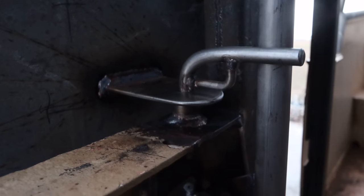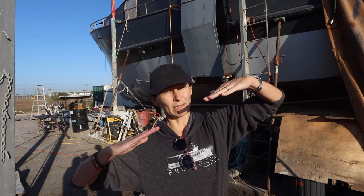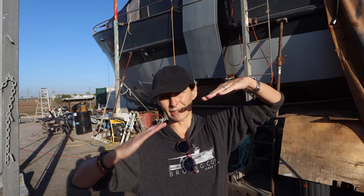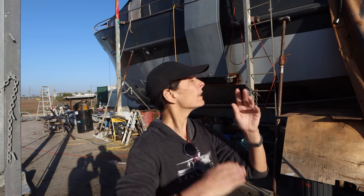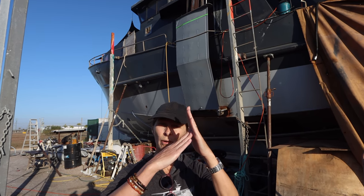The other thing is, one person actually asked, a little bit of a confusion there, I think. When you're at sea, the wings are down the side of the boat. When the boat's moving like this, how do the wings not flop around? And it's because it's hard bolted. The arm, the wing, and the bulwark make a tripod. It's locked in. Hope that explains a few things for you guys.